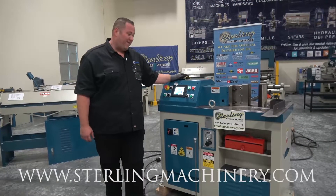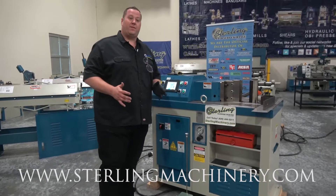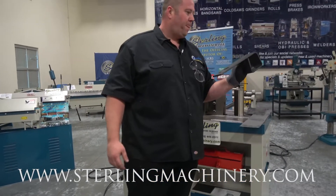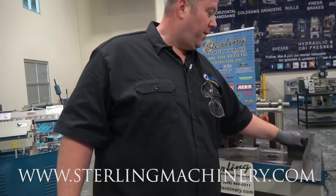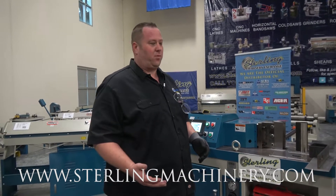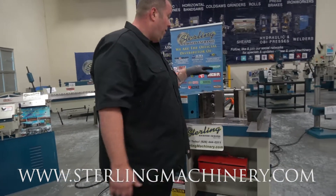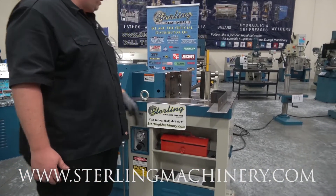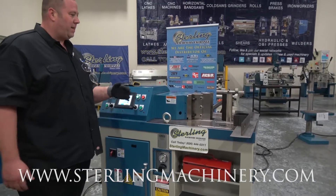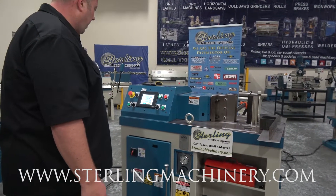Bailey HPB 45 NC — one of my favorite machines. I've been in places where I've seen people using huge press brakes just to make something like this. That's kind of dangerous when you have a 20-foot press brake with a guy putting material in using some timing — I've seen it even on mechanical press brakes. This one gives you a nice small footprint: 45 tons by just about eight inches of clearance. Really nice, simple machine to use. You can basically program it to come and stop wherever you need to, make a really nice bend, and we'll show you how it works.